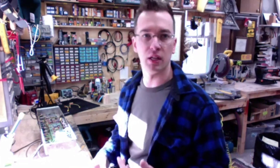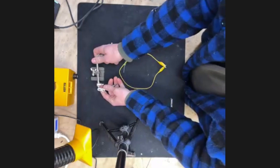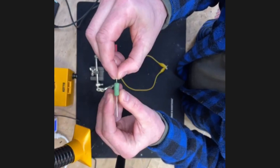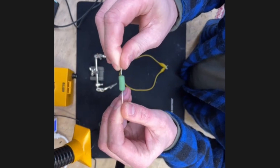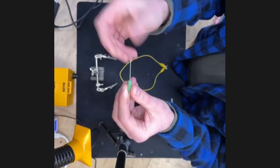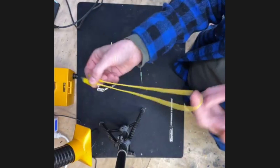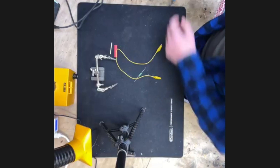I've got my little helping hands here. This is a 2k 5-watt resistor. You can use anything from around 500 ohms up to about 50k, but 2k is a good middle ground. If it's below 500 ohms you might get a spark when you connect it; if it's too high it'll take too long to discharge. Then you just need alligator clips — either make your own or get pre-made ones — plus shrink wrap, solder, and an iron.